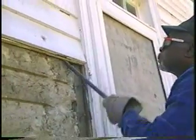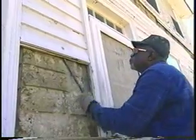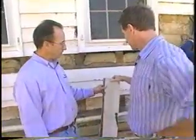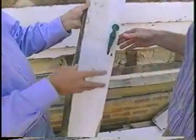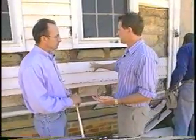The alternative was to power wash, mechanically and manually scrape and sand this, but through time the checking would reappear, and we didn't think that would be aesthetically pleasing. Now, what other issues are we looking at here? Well, this doesn't have a vapor barrier, so if you can see the back, you can see moisture on here. The moisture has no place to go but to push through the paint film, causing it to break through and chip.